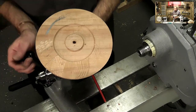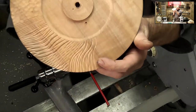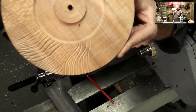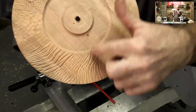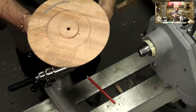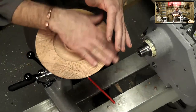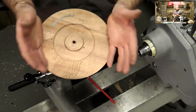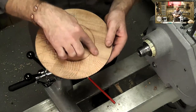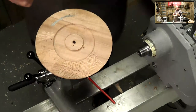Let's have a quick look - we've got a range of different patterns now on this curved flowing shape. I love doing this. As far as I can describe it, it's almost like a wood grain effect. You can emphasize things at different bits. Putting some texture into the surface - if it was flat and you'd done the whole surface - you could spray something like some ebonizing lacquer on it, sand it back, get a great black effect just in those lines. It could be really different.